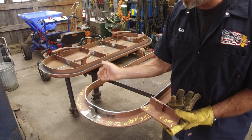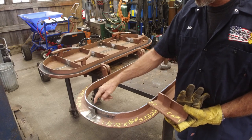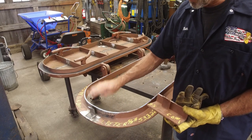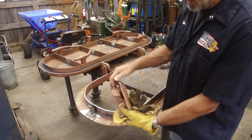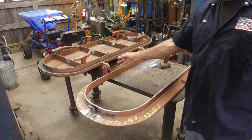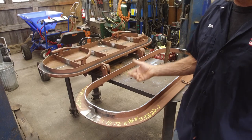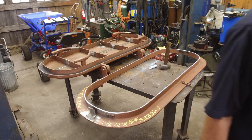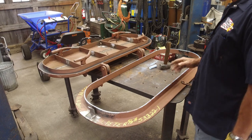It comes down, making sure that the door doesn't drop down, or an indicator as far as the height of the door. As the years go on and this knife surface wears down, it's got enough height right in here. Right now the door sits right at it, the same as it did on this one right here. It just barely touched that corner. The hinges are new, everything is new on here, so we don't have a bunch of slop where this thing is down. It closes pretty well in the same spot, give or take 10-15 thousandths. That's how tight it is as far as the play this way here on the hinge.